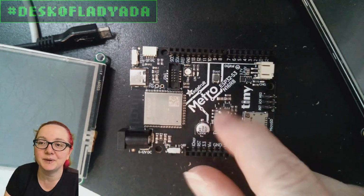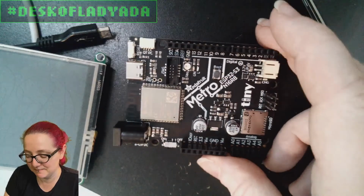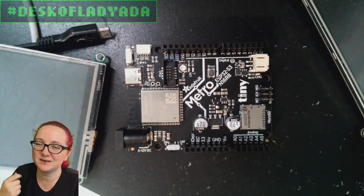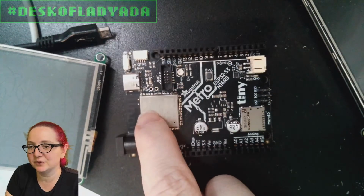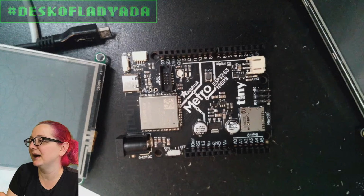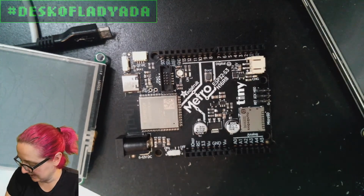The Metros use a lot of pins. All the pins are used, so I had to start using pins that are normally not recommended, like the SPI voltage selection pin, and the NeoPixel is driven by the debug output pin, which we don't use on this board.